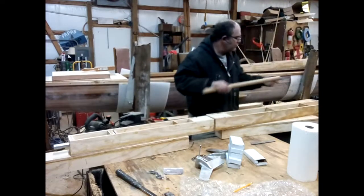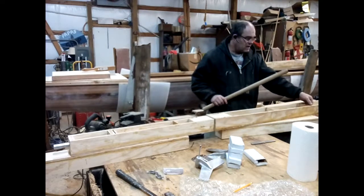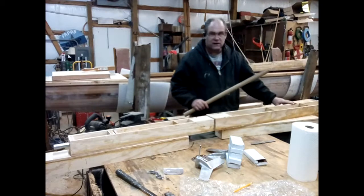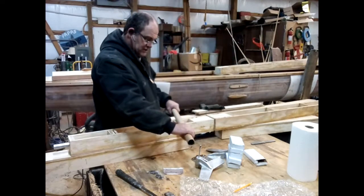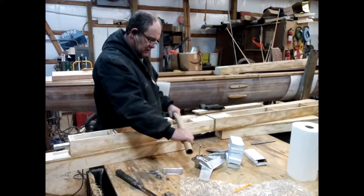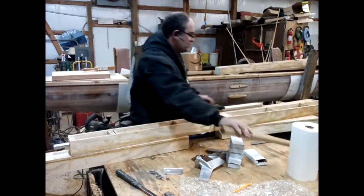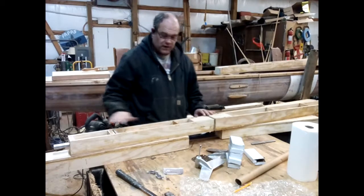You'll notice over here toward the center that I have essentially blocks or spacers inside the hollow iako. And the reason for that is whenever you press a beam down like this, you'll see it's collapsing here and crushing, and the sides crush in. So if you put spacers inside it, that stiffens it and makes it not do that. It makes it tremendously stronger.